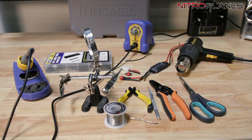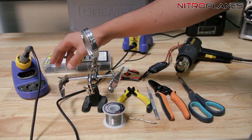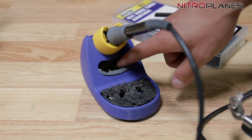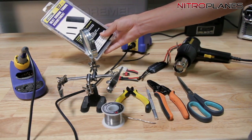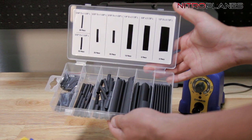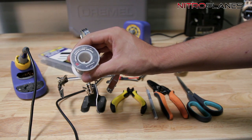Let's take a look and show you guys what you'll need to get the job done. The first and main thing you are going to need is obviously your soldering tool. I have a soldering station here. A nice little thing to have also with your soldering iron is a sponge with some water — you can put it in a little cup. Also have a little wire sponge here. That's always good to clean off any bad residue that builds up from heat on your soldering iron. Also, a little heat shrink tubing is always good to have. You can get this at Harbor Freight, Home Depot, or Radio Shack — just a wide assortment of heat shrinks. I have some 60-40 solder here that I bought at Radio Shack. Works great for me all the time.